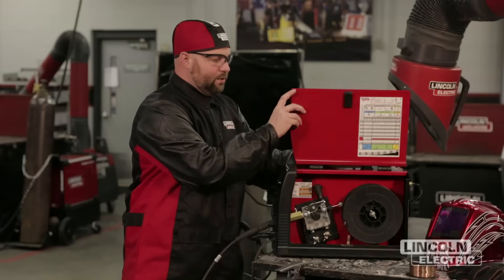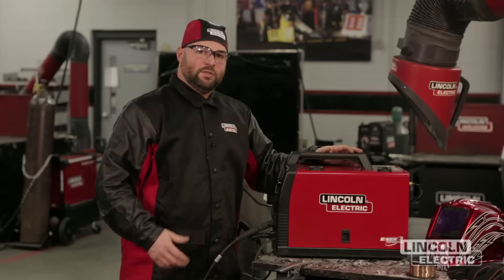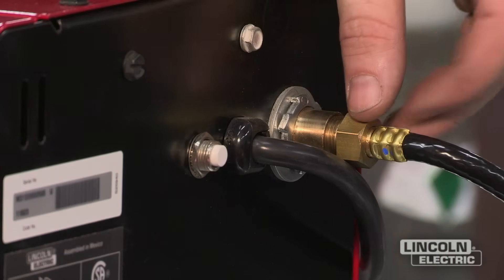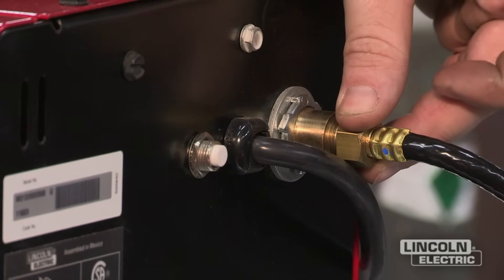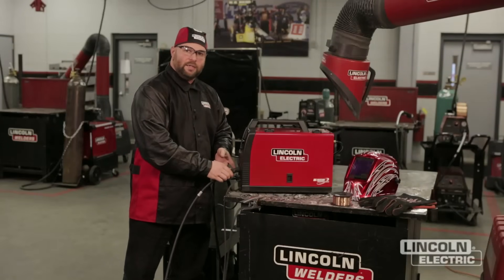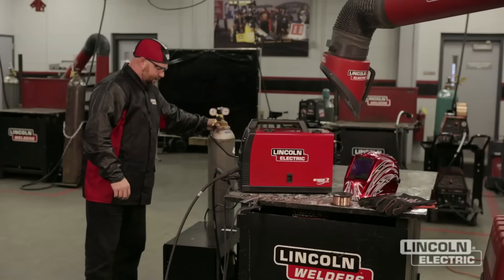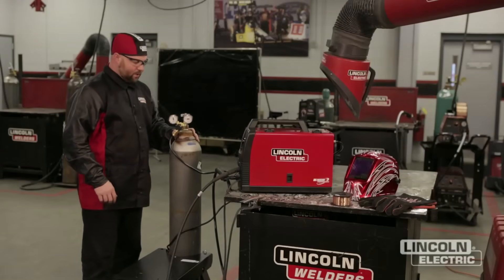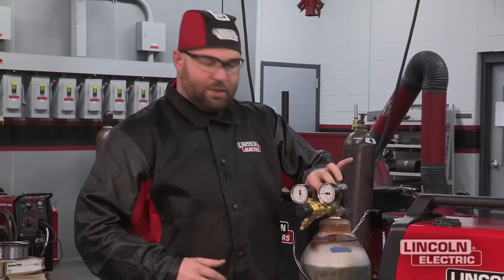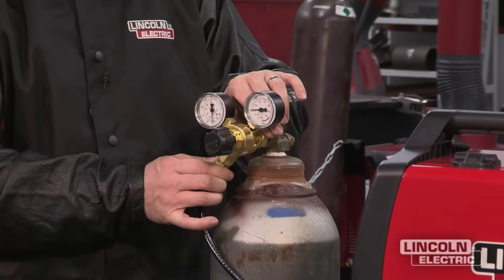Moving to the back of the machine, close the door. If you're running the GMAW process you need shielding gas. Some common troubleshooting tips: check your connections — we've got the input connection for gas coming into the back of the machine, be sure that connection is tight. Also be sure that your gun is seated all the way into your brass connector block so you don't get any gas bypass in the gun. Be sure your regulator is set to the proper gas flow and reference your operator's manual for that. Make sure the brass connector on your regulator and the gas line on your connector are both tightened down.